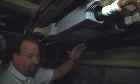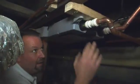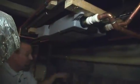There's only two ways Moen recommends that you install this valve. It would have been in the vertical position upstairs behind the shower, but I have a toilet and a closet and didn't have the room for easy accessibility, so we mounted it horizontally here. Before doing that, we needed to put some 2x4s up. Moen provides 3 holes on this side and 4 mounting holes on that side to secure the unit.